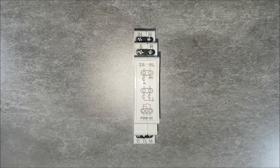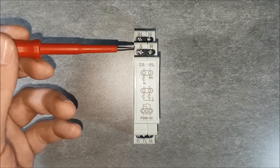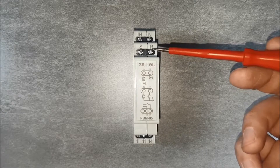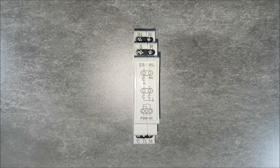Group control is done by the centrally controlled terminals. This is the terminal set marked with the letter S. While the phase potential is applied to this terminal, the relay is turned on. The reset terminal is marked with the letter R, and performs the action of non-conditional switching the relay off.